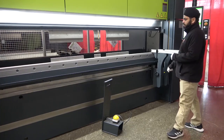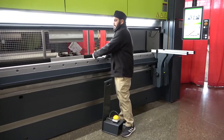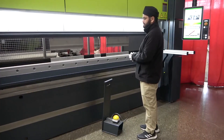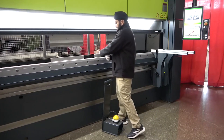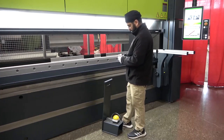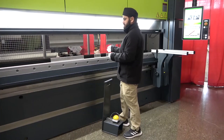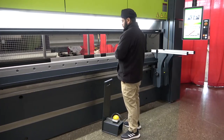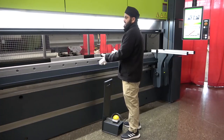As I go in, I leave the job on the tool, and when I come out of the safety zone, the machine will automatically cycle without me hitting the foot pedal. The machine goes down, makes a bend, goes back up. The operator goes in, takes the old part, puts the new one in, and as I clear the safety zone, the machine automatically cycles — so you could be doing this all day without ever hitting the foot pedal. If I break the cycle, the safeties are still on — the machine stops and goes up automatically. The machine is fully compliant with the Z142 safety codes and is completely legal in Canada and all over the world, and no one else has this feature.